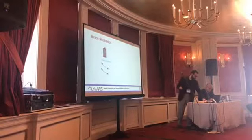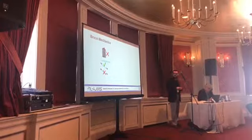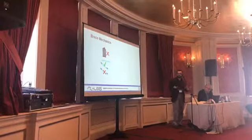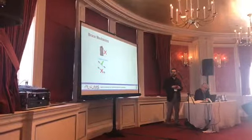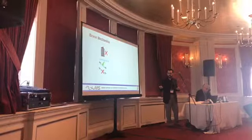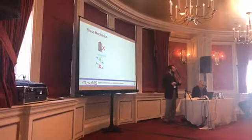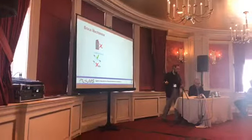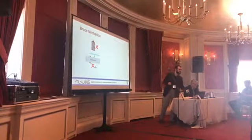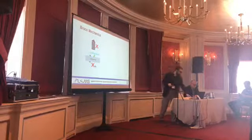So if we consider a conventional brace, under tension it takes the load and yields, but still takes the load without much loss of strength and stiffness. However, in compression, after a few cycles, it will develop plastic hinging, and then the strength and stiffness will degrade, which will lead to some kind of failure. So it may cause safety issues for the occupants of the building, not to mention the economic losses.